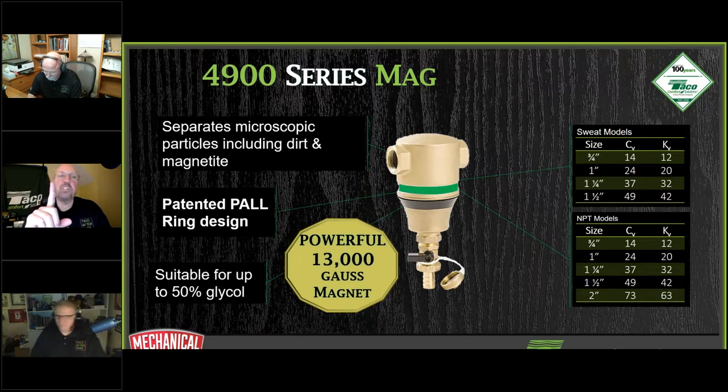No, 14, 15. As you can see, you've got 37 gallons a minute going in there. I think you're over pumping. So we're going to get the dirt and the magnetite coming out of solution. The magnetic ring is going to hold it in place. And again, with the stainless steel and bronze, glycol is not a problem.